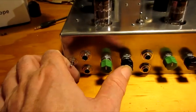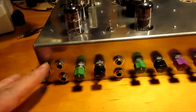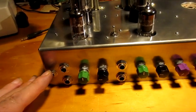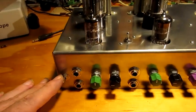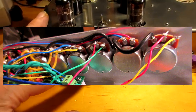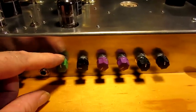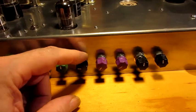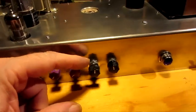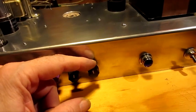When laying out the chassis, it was hard to fit all of the control knobs, especially when adding the bypass capacitor selector switch. I put the potentiometers on one inch centers, which is about as close as you can mount full-sized pots. Keeping them as close as possible minimized wiring and helped keep the knobs away from the power supply end of the chassis. I had to use small knobs so they would fit with the tight spacing, and I chose different colors to help distinguish tone, volume, and feedback controls.